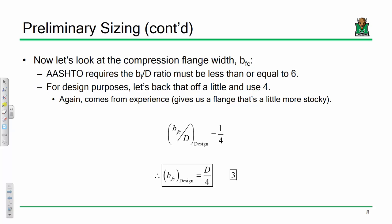And what you want to try and do, I mean, honestly, you want to try and use as few longitudinal stiffeners as possible. Like, if you go back to old plate girder bridges that were built back in the, you know, 50s and 60s and stuff like that, you'll see them all over the place. I mean, they're like every depth along the girder. More modern bridges, you might see one or two of them, and that's it.